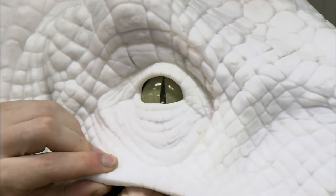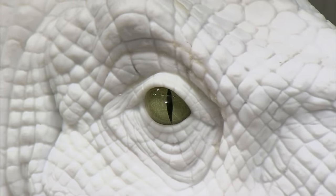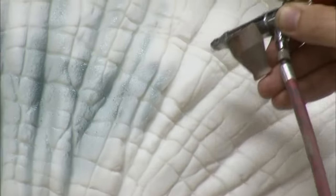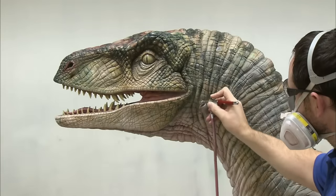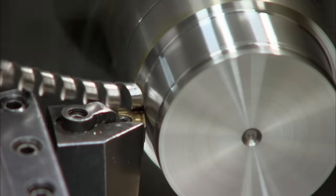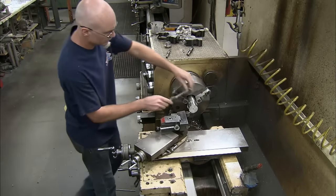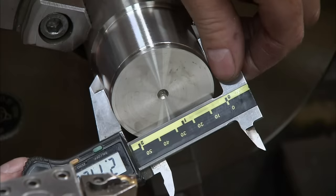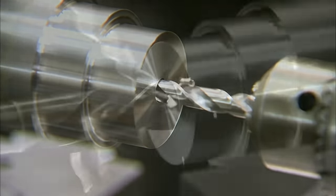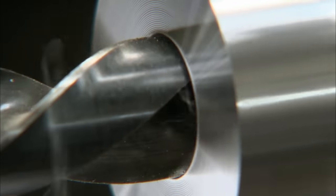The position and fit of the thermoformed eyeball is also checked. A character artist uses an airbrush to add colours to the skin with silicon paint, with multiple layers adding to the level of detail and realism. The mechanical parts of the metal frame are now machined. The model will require thousands of stainless steel and aluminium pieces to provide fluid motion. Holes are bored to allow bearings to be placed inside shafts, with each piece custom-made to suit its specific function.